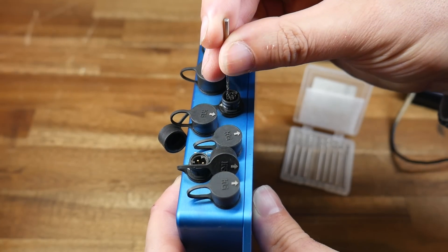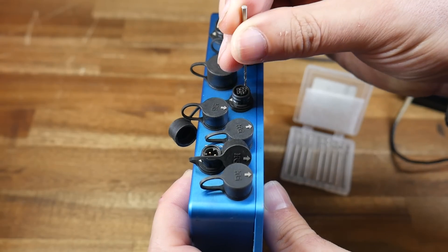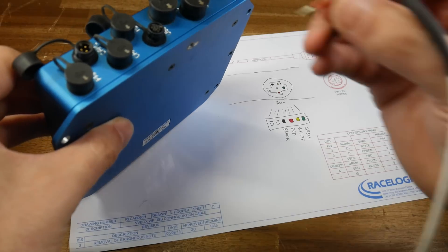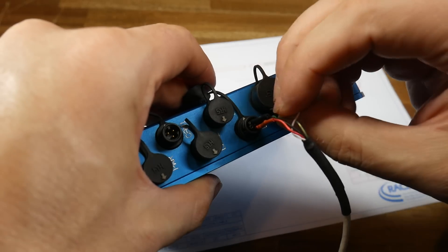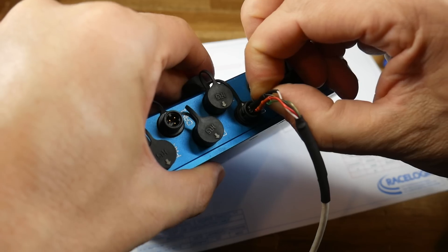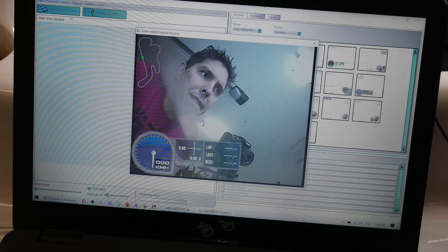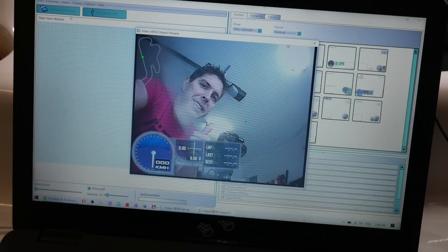The pins in the original plug must be very tiny, so to help the DuPont connectors go in I opened up the plastic very slightly with a PCB drill bit, then tried to compress down the pins with a ferrule crimping tool to get them as compact as possible. After printing out and colour-coding the actual cable's datasheet, I very gingerly inserted my makeshift pins into the port. It was very hard to get them in — they fell out if you looked at them the wrong way. But as dodgy as this was, it was enough to progress: putting the V-Box back in the vehicle, powering it up, and getting a live camera feed through the cable. The cable works.